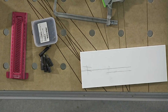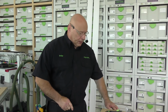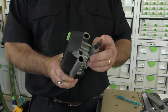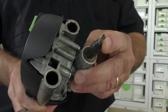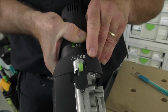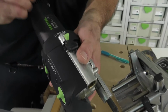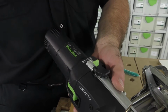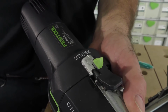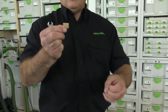So here's the confusing part to all of this, is when you pop off and you put on that 4mm Domino cutter, this scale goes haywire on you, okay? Because those are not your plunge settings, because this is 10mm shorter. So if I set it, and here's your setting to do that blind tenon, you set it at 20, and you're actually plunging what, Big D? 10mm.